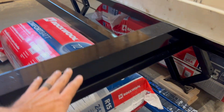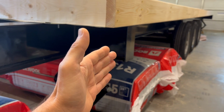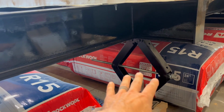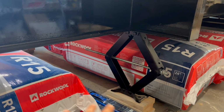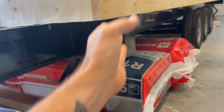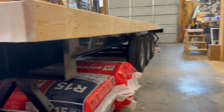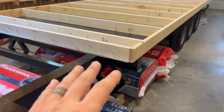It's a trailer built with two 8-inch structural I-beams on either side. They create the main structure of this trailer, this chassis. And when you get this in place, you can put it on any sort of what I would call piers, so it creates a pier and beam foundation. The piers can be as simple as trailer jacks like this, if it's a more temporary setup, or you can pour footing pads and block up actual structural piers and rest this tiny house on them. I would recommend at least 6, maybe 8 piers. You can anchor it down into ground anchors with, I think, 4 or 5 D-rings on either side. So you can create a very permanent, strong structure foundation for a tiny house this way. It's one of the reasons why we like it.